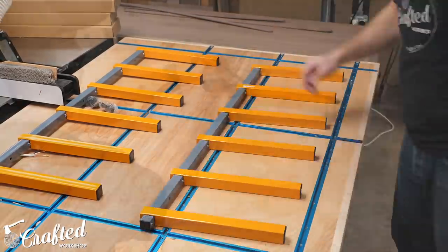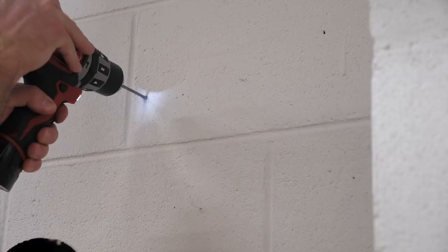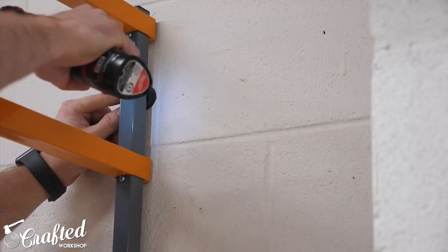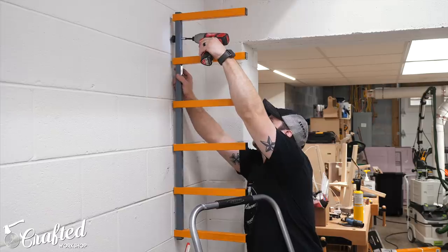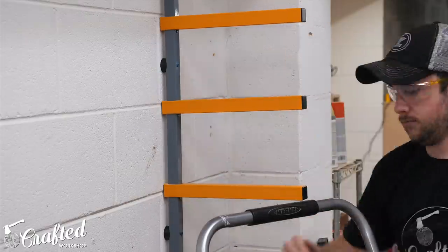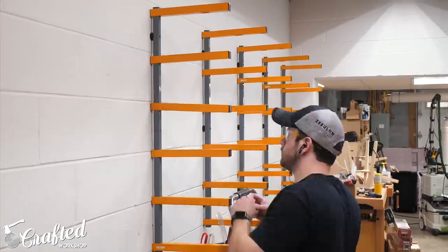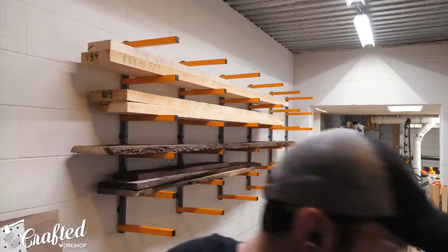The racks go together really easily — just a couple of screws hold everything in place. To install the racks, first I marked 16 inches from the closest wall and then marked the hole for the uppermost screw for the rack. To attach the racks to my concrete block walls I used two-and-three-quarter-inch Tapcon screws. I used a masonry bit matched to the diameter of my screws to pre-drill the holes, which is a loud and messy process — I'm always a little jealous of people who have drywall and stud walls in their shops. After hanging the rack on the first screw I checked the rack for plumb and then marked the locations of the other two holes using a drill bit. I then removed the rack, drilled the holes to full depth, and reinstalled the rack permanently. To install the second rack I referenced off the first rack, making sure it was level, and continued the process. I kept working my way down the wall until I had all six racks hung. For 60 bucks total I really don't think I could have done better making this myself, especially when I consider the labor time involved in a DIY option.